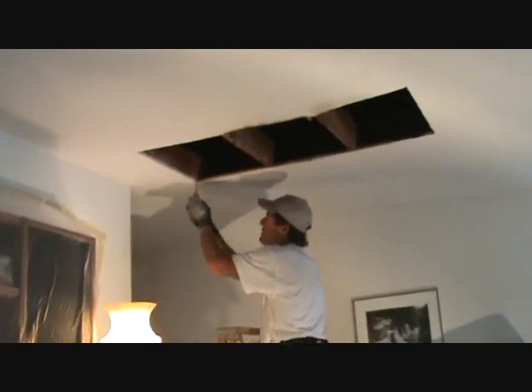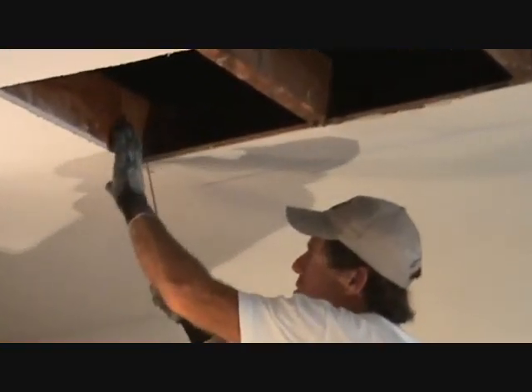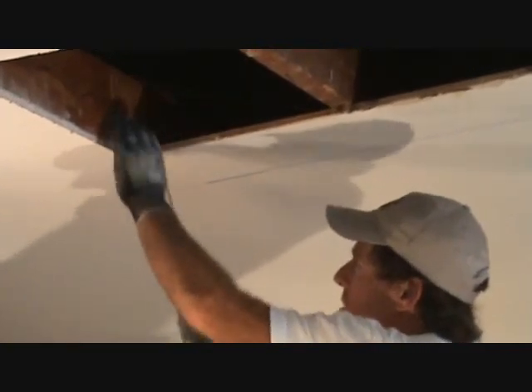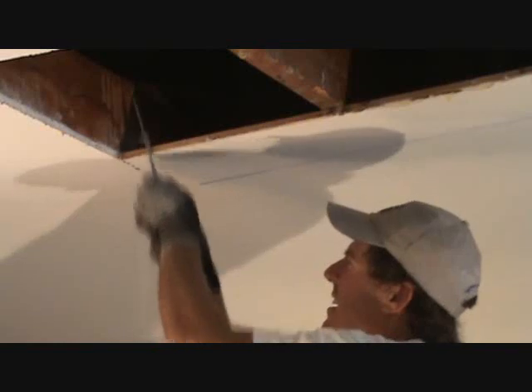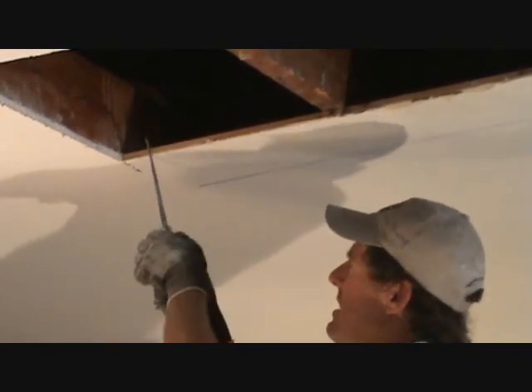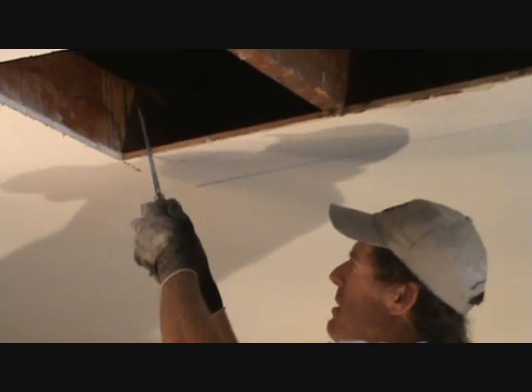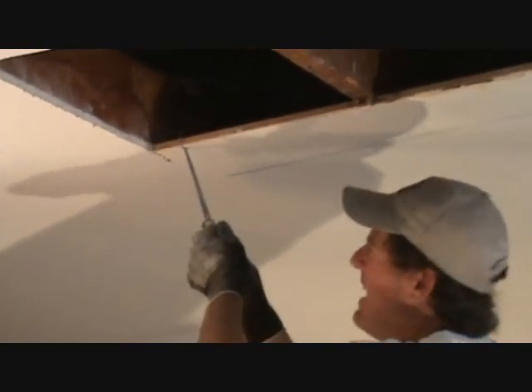Now, I don't have a line here, but if you use your saw you can usually feel the edge of your joist. Or if you have a question about that, you can cut it short of the joist. Cut over to your line, then you can finish up once you take out the other piece. Okay, so that's what we'll do here — little strokes, not hard, just go nice and easy.